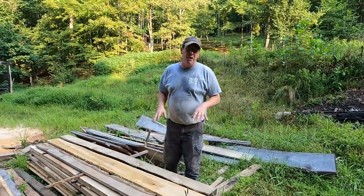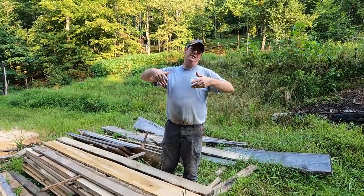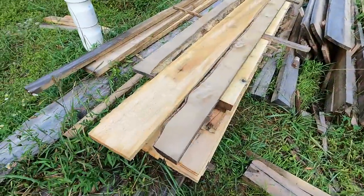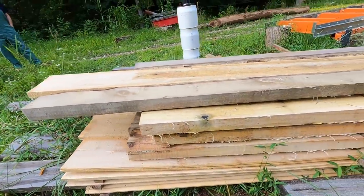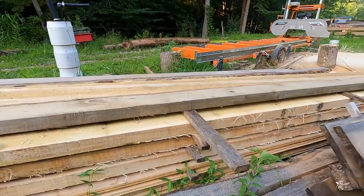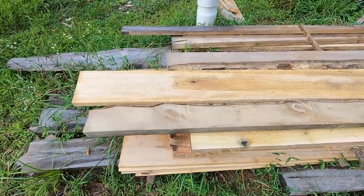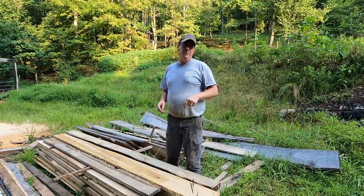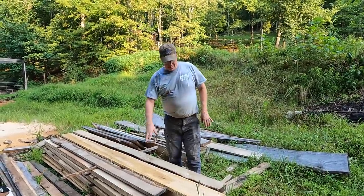All right, so that worked out perfectly. That last log, I was able to cut an extra bit off and turn it as I was cutting down my cant, as I got my 6x cant, and I was able to squeak one more 6x. It has just a little bit of wane on it, but no big deal. These are actually 8 feet long, and my measurements show that with the amount of overhang that I want, it should be about 6.97 feet. So I'll have a foot of rafter to cut off there. Plenty to play with. So it was awesome. Three logs gave me my 12 true 2x6s. So we've got them ricked up here, going to let them dry out some, and just put a little extra weight on top to hold them down.